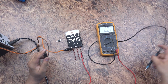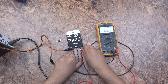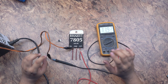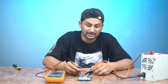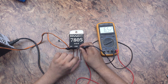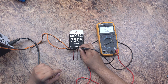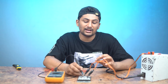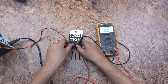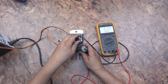I have set up the test with a 12-volt supply. I connect 12 volts to the input and I attach the ground. Now you can see the output gives 5 volts — that means our 7805 regulator is working correctly. Now I am going to test it with a motor running at 5 volts.